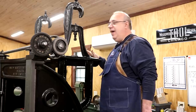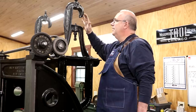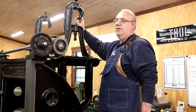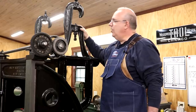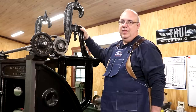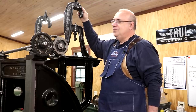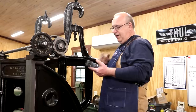My challenge is putting some bearings in here to hold this counter shaft and support it. Originally, there would have been blocks in here with babbitt in them. I seriously considered going back that route, but at the end of the day I'm going to try to keep things simple and as maintenance-free as possible. We're going to put ball bearings in here. Some people are probably going to scold me for that, but that's the direction I've decided to go.